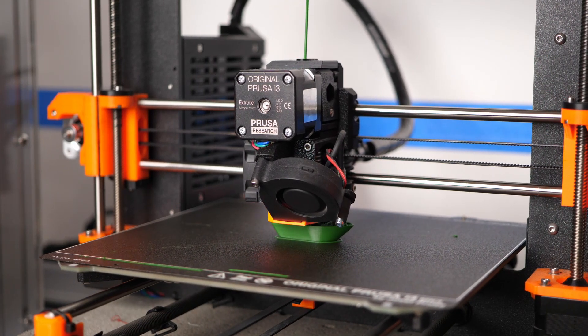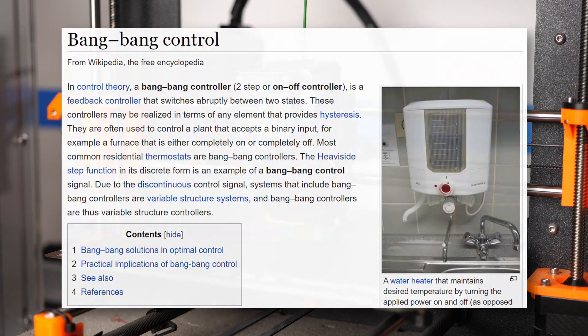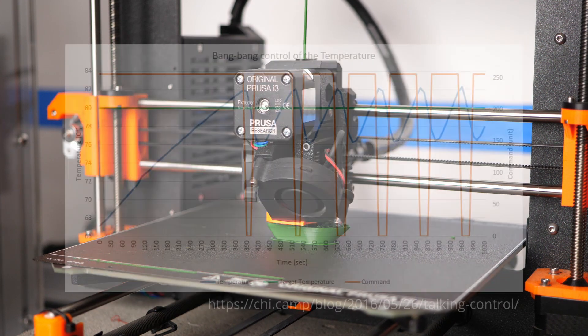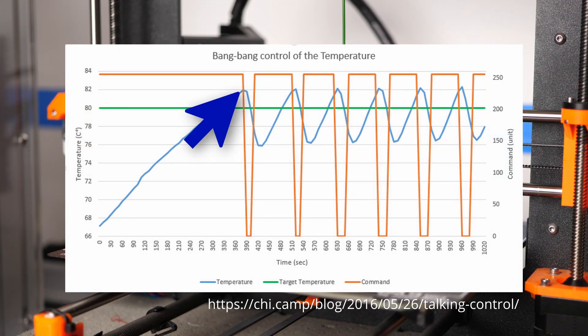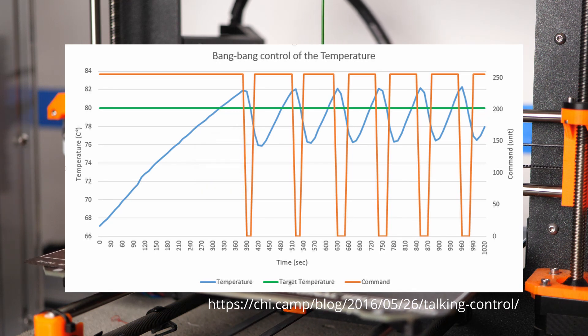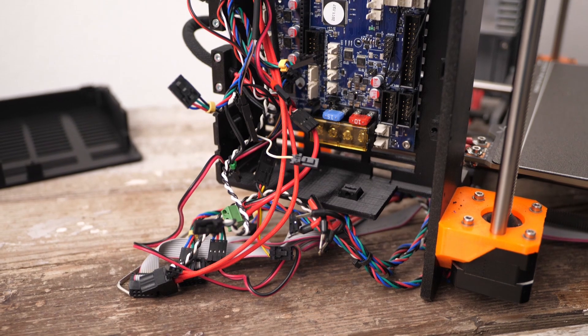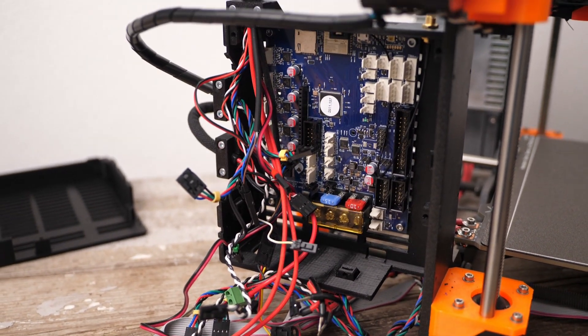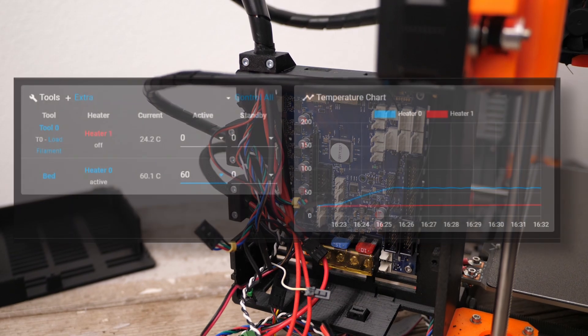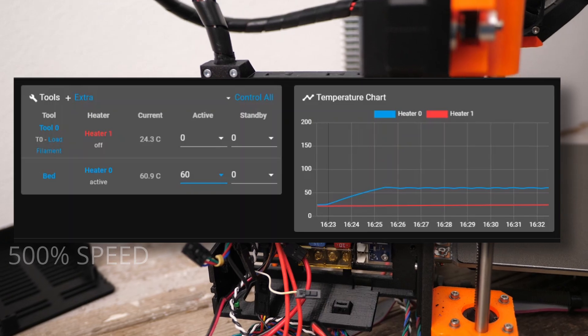In the old days, heated beds were often not controlled via a PID scheme, but using a so-called simple bang bang hysteresis controller. This means that you just switch off the power to your bed when the temperature is slightly above the set point and turn it back on when it gets below it. Due to the thermal mass of the system, this will lead to a slow oscillation of the temperature around the set point. So when I set up the Duet board and noticed the chirping noise, I switched to the simple bang bang control. The annoying noise was gone and the temperatures fluctuated only around ±1°C.